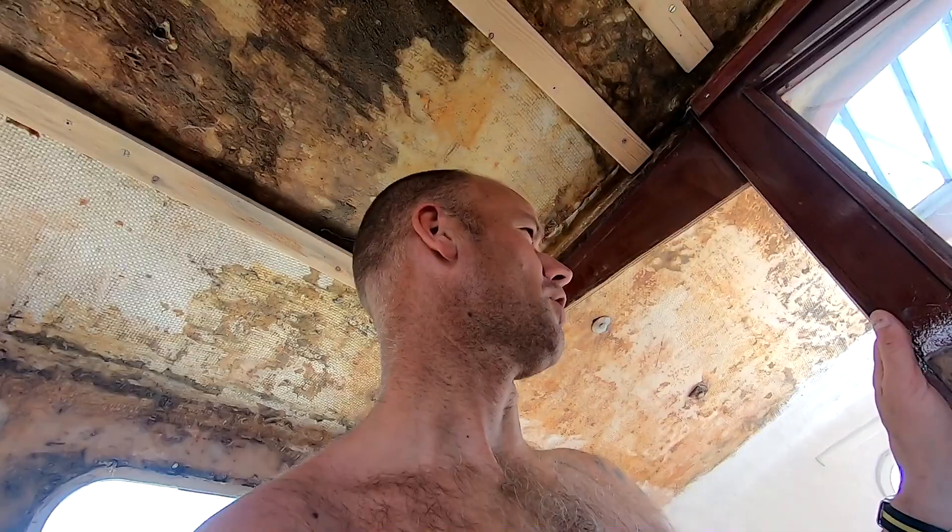Hey guys, it's now midday. Bit of a disaster this morning - as I was sanding down I found a couple of bits of fillet I'd completely forgotten about. Don't know how I hadn't noticed them. I decided to get some epoxy in there. There's a tiny little bit on the corner down there as well. Got that in this morning - it's only been about six hours or so, hope that's enough. I can now sand it and get some 2K polyurethane on.